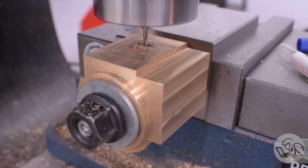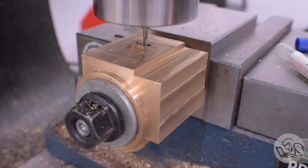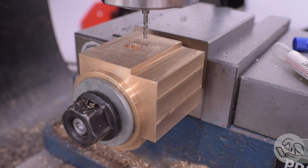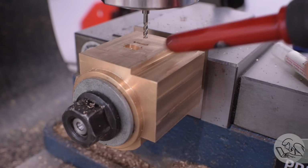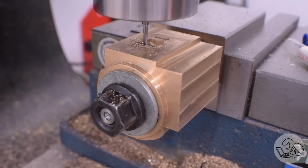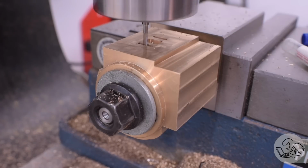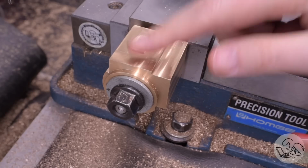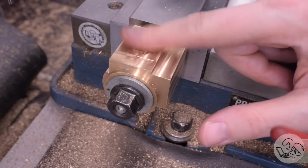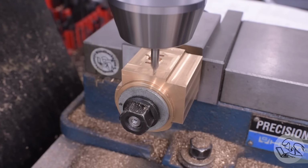However, they're printed in a book, and the book printing process has scaled everything by an additional arbitrary strange amount of something like 3%. So it's really not reliable, and because the drawings are so small, the lines are quite thick for the size of the drawings. So measuring off the drawing, really not an option, and sometimes in cases like this, you just have to make an educated guess. Now, in this case, the depth of them isn't all that critical. All that the depth is doing is giving us a larger target to hit when we go to drill out the mating steam passages, as you'll see.